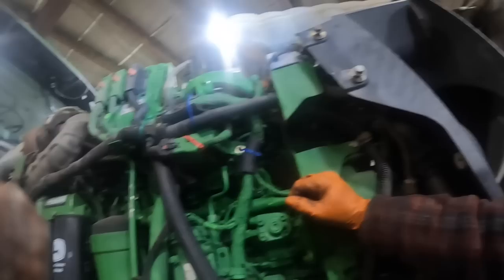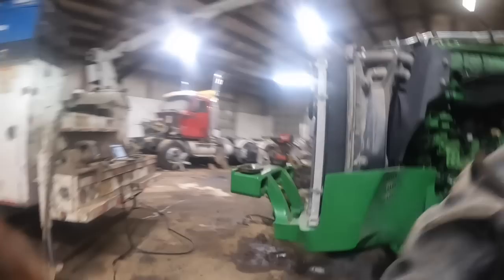Okay, so lots and lots to take off here. Let's go get the ground off the battery. Trying to decide. I think it'd probably be better to just pull the post off. I was going to take it loose right there, but if it's still hooked to the battery, it could touch the ground somewhere else, and it'd be better to unhook it from the battery.